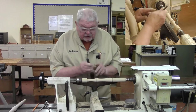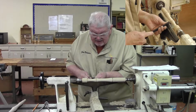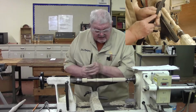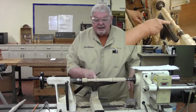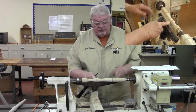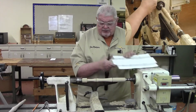I'm using the long point of the tool down. And I wanted that just a little more radius, so I made another cut there. Now, I can't improve that with sanding. I gotta leave that alone. So from here to here to here, we're okay. Now down at this point here,